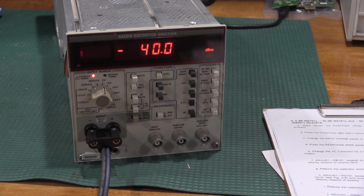Not too worried about the last step where it took a while to get there. The notch filter does have to work really hard. The unit's open. This is an incredibly noisy environment. This is not a shielded cal room by any stretch of the imagination. There's switch mode power supplies everywhere. There's two massive computers behind me. I control noise to the best as I can, but it's everywhere down here.